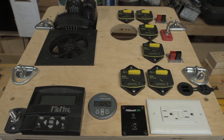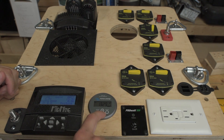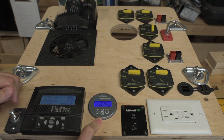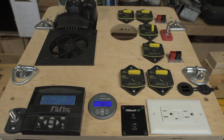Here's a demonstration of the master breaker turning on — it's a 150 amp DC breaker, currently turning on the Midnight Classic and energizing everything. It gives you an idea of what the panel layout looks like. Those D-rings on the left and right are used to lift it with an engine crane because the thing is so heavy. One of my original design criteria was to have a fairly light build, but I failed miserably — it takes two people to lift. Anyway, I hope you found this video interesting or useful. I have a lot of the components listed in the description if you want to check them out. Please leave any questions or comments below, and as always thanks for watching and please subscribe.